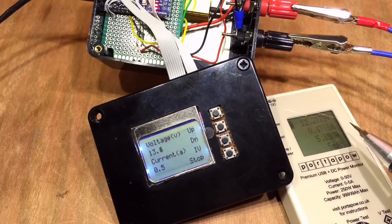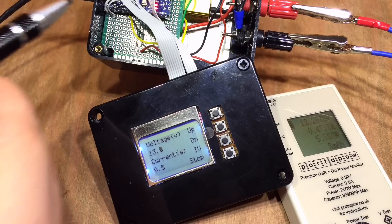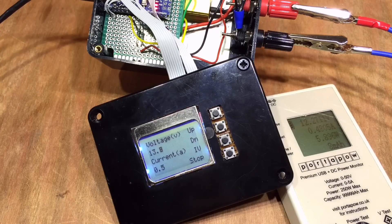That's not bad — it's within about 30 milliamps of half an amp all the time. I'm pretty pleased with that. The voltage reading is off by probably a whole volt, so I need to look at the voltage sensing and adjust the code a little. That's probably because I'm basing this on 5 volts and the USB power supply might not be exactly 5 volts, so perhaps I need to look at the voltage reference in the Arduino code. The lowest I saw was 455 milliamps targeting 500, so it's a little on the low side.